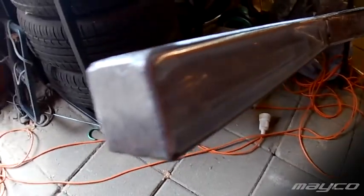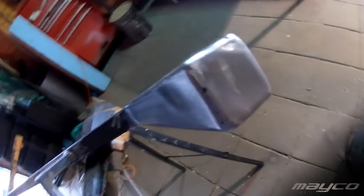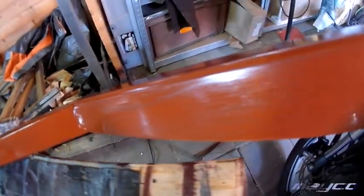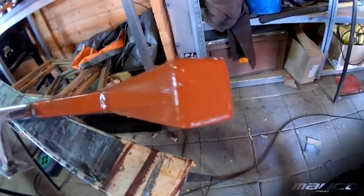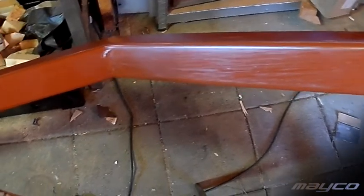This is important because after those 10 minutes, the machine needs to cool down. It has happened to me sometimes, but you can work around it. If you are looking at a machine and you really want to thrash it and go for long distances of welding — especially with thicker sheet metal like 6, 8, 10, or 12 millimeters — then you should really look at that duty cycle number, because you'll hit the 10 minutes quite quickly.